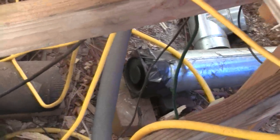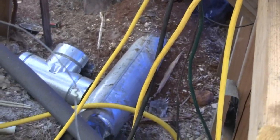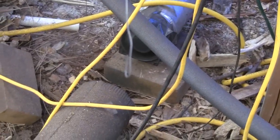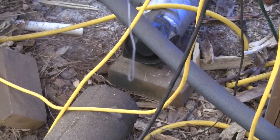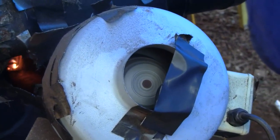Once I'm doing that, I won't need the main blower down there blowing air in. There's the bottom of the burner barrel and the air inlet tube — a small computer muffin fan, and then a big blower with a gap between the two. I just adjust the gap until I get the pressure I want inside. That's the positive pressure, and I balance that with the second blower up here blowing into the feed tube.